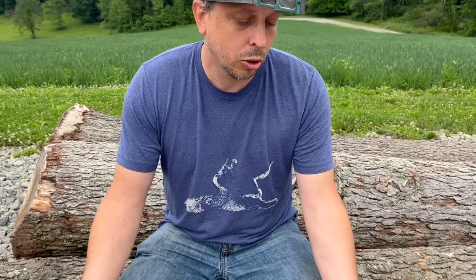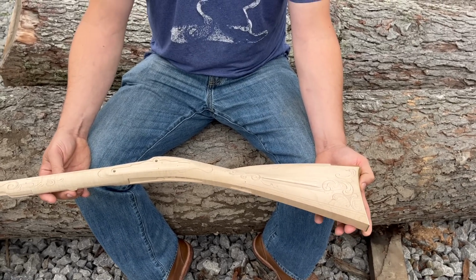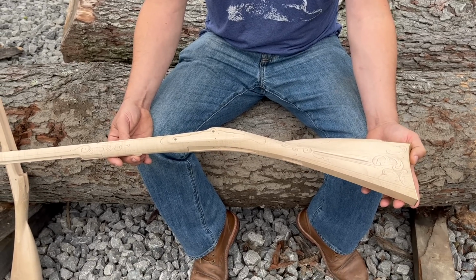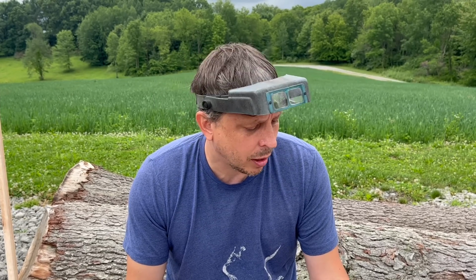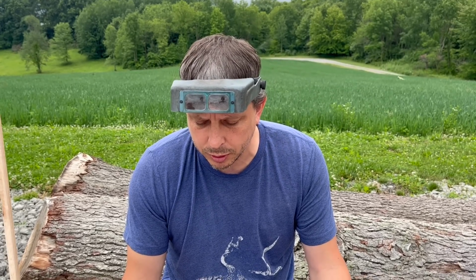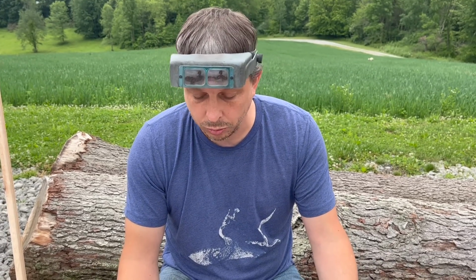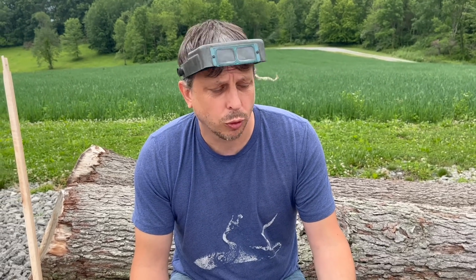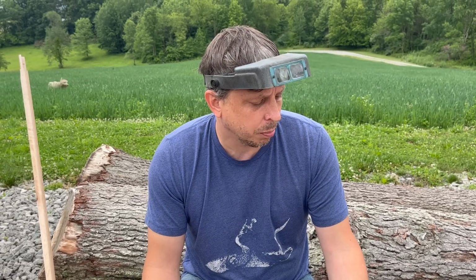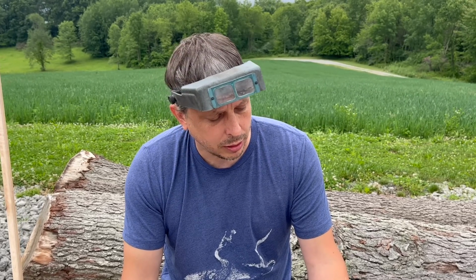Yeah, so one thing great is our machines create a very smooth surface on the stock, so there isn't a large amount of sanding that's necessary. So you don't have to worry about raising the grain. In my experience, we've done some experiments with this carving and stocks carved, and raising the grain is not critical. We've gone over it with water-based aquafortis stains, and not noticed much compression of the incised lines or anything like that. So basically just light sanding and you'll be ready for staining.